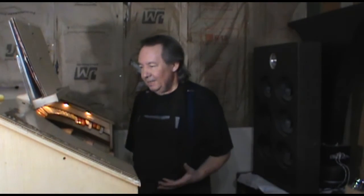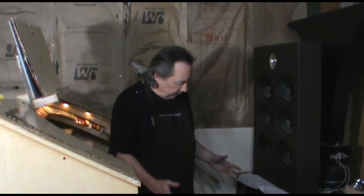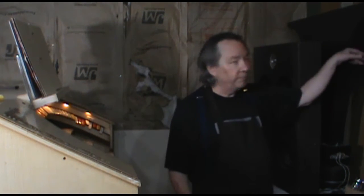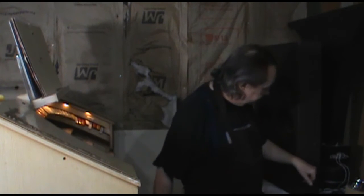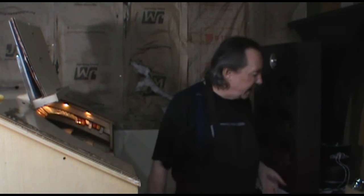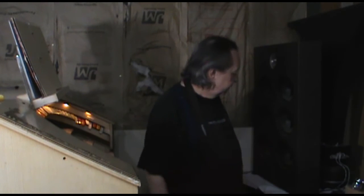Starting to get a theater organ coming back together here. So this is promising to be very fun to play with. We'll see how this all holds up over time. The next thing I kind of have to do, this exponential horn speaker that's on the brass side, when you set it on its tail like that, the plugs that hold the speaker wires get pressed and then the speaker wires come loose. So I gotta fix that. I gotta put a block on it or something, some kind of feet to clear that.